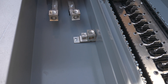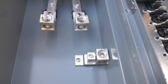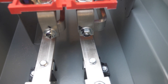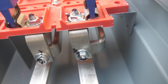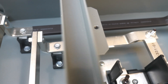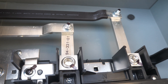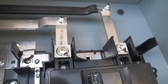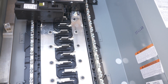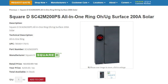The reason I chose this particular panel is that the city is coming to install underground electrical service. Currently the whole neighborhood has overhead service. The city's rules require panels on an outside wall — in my case on the garage wall — and they insist on a surface mount panel, which this one is. The ability for this panel to accept overhead or underground service makes the whole process much easier. I can get a permit to install this panel with the existing overhead service, and when the city runs the underground service, it will just be a matter of disconnecting overhead and connecting underground. I also wanted the large number of circuits for expansion and the ability to easily add solar power.